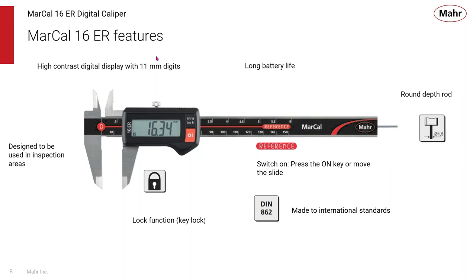It has unique features of the locking function so that you can make a measurement. Maybe you're reaching around and you can't see it. You can lock that feature. And even if the scale moves on you, you'll still remember the value that you made. This is made to DIN standards in terms of calipers. It incorporates a round depth rod. It has long battery life. It has our built-in reference system. So all you need to do is turn it on or move the slide and you're ready to begin measuring.